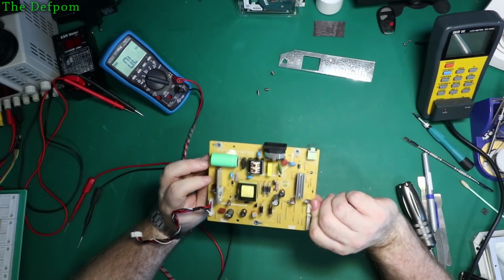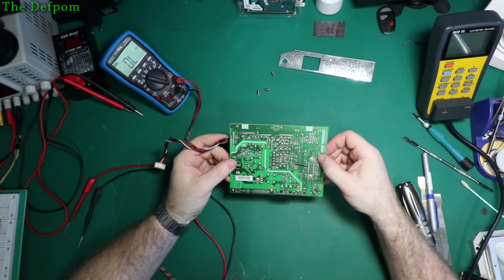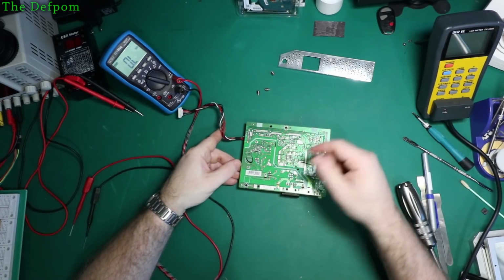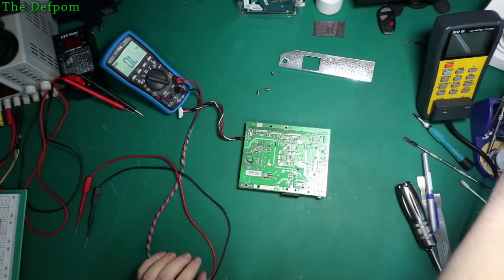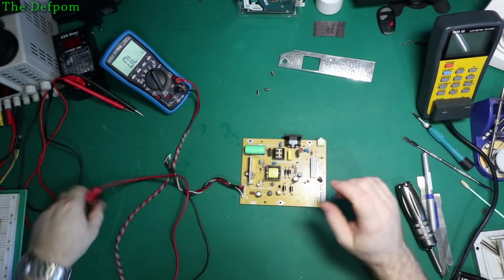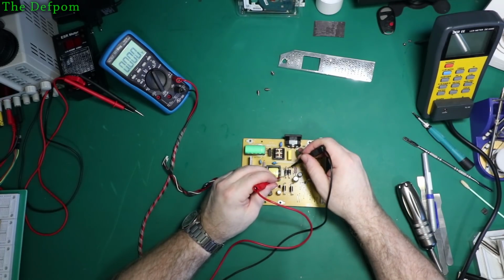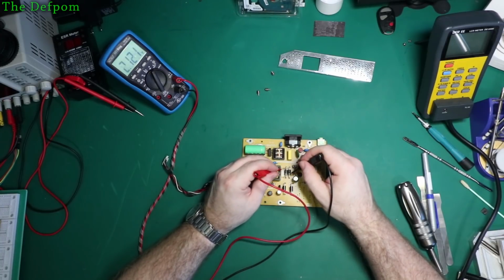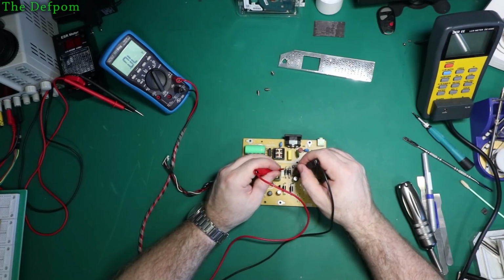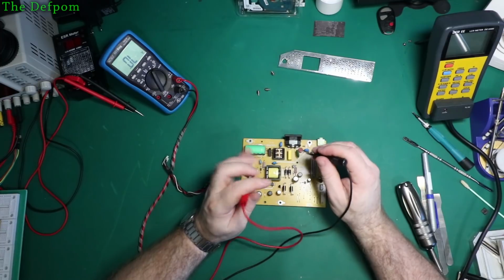So yeah, I suppose I might just try lifting a diode and see if I can determine if one of these diodes is bad. Because that could be why that side's dead, it's because it's loaded down. We'll go for that first. So, where was I looking before? So those ones on it. Yeah. So these are looking like a dead short, don't they? They really are.